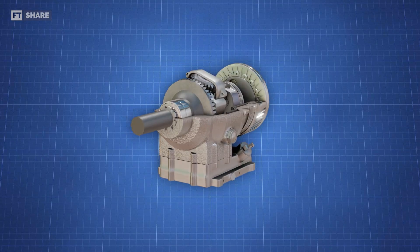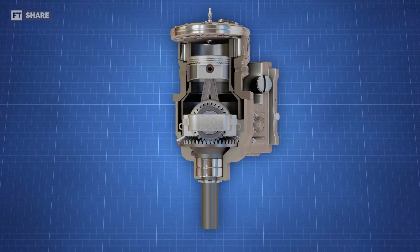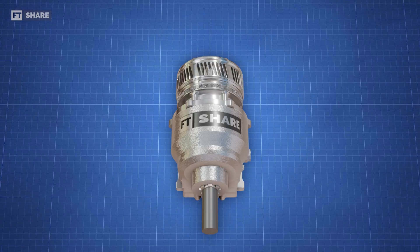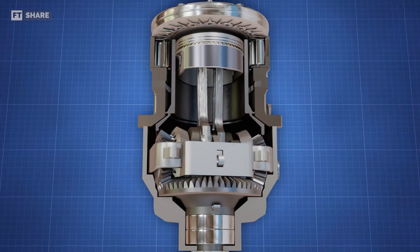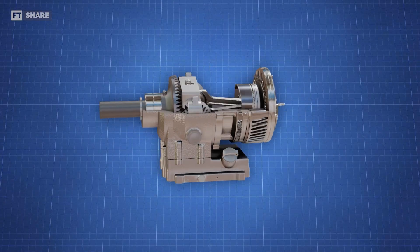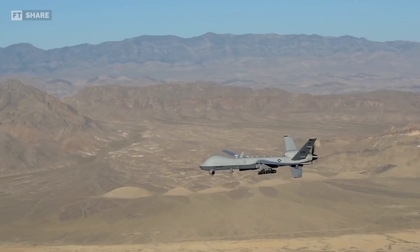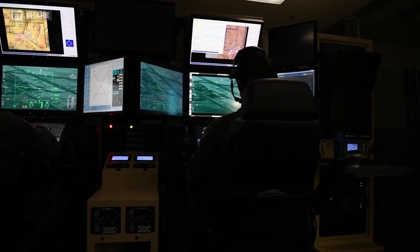The Avady engine may not be suitable for automotive applications — whether four-wheeled or two-wheeled, such as conventional cars and motorcycles — due to inadequate performance and high cost. However, this engine has potential in very specific applications, such as military drones or UAVs, where a lightweight and compact design is crucial, even though they do not require high performance or long-term durability. The Avady motor's innovative design offers significant advantages in balance and friction reduction, but its limited power and inability to scale will limit its applications, with the greatest potential in military drone development.